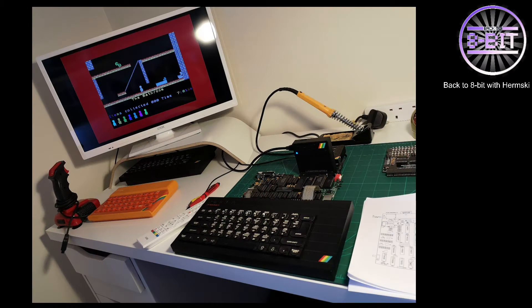That was a picture of me testing it out for the first time. As you can see, I'm not using the white case I originally showed — I just quickly connected a spare keyboard with a membrane from a Plus case and connected it to the board. Then I connected the ZX HD interface into the back of the edge connector so I could connect it to my TV via HDMI. The board does have a plug for RGB straight to a SCART socket, but when I tested it I plugged straight into my ZX HD — and there I am playing Jet Set Willy.